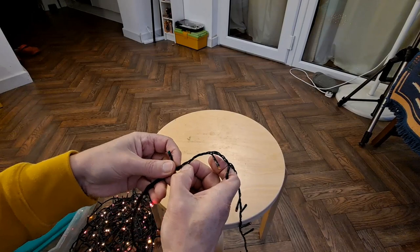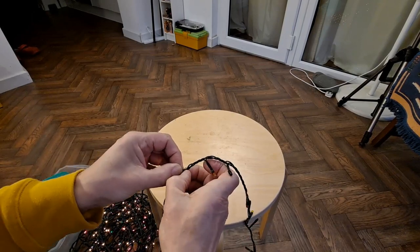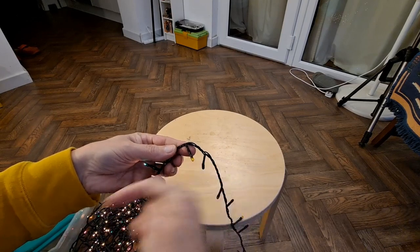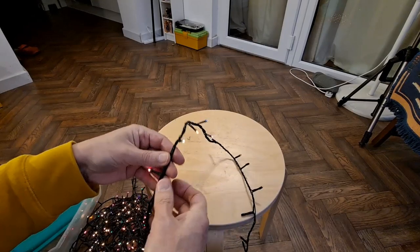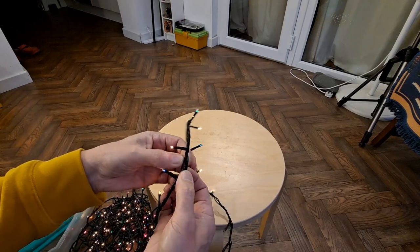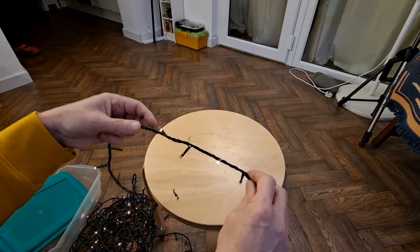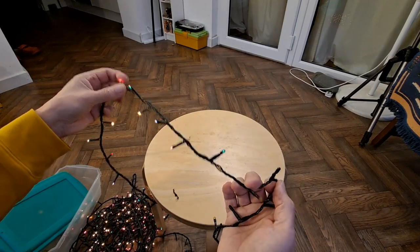It's basically the sequence of pulses of current sent down the different wires in different directions. So LEDs light up when the current flows one way through them and don't light up when the current flows the other way. And then by doing that with sets of, got five wires there, you can wind them together so they go in sequence, chasing, that sort of thing. But clearly, from that point on, those aren't going.